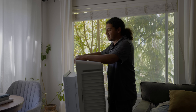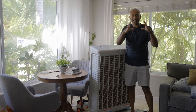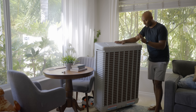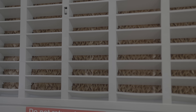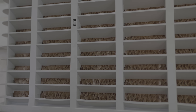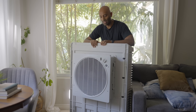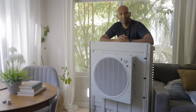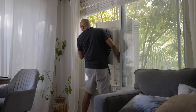Next, let's talk about an evaporative cooler. Evaporative coolers come in all kinds of sizes — they even make little tiny ones for your face — but this is a massive one rated for a 2,000 square foot house. If you look up close you'll see little grills that water trickles down, providing a lot of surface area; as water goes over these coils some of it evaporates, cooling the air coming through. This was about $660 at Home Depot, and let's try to get it installed in this window.